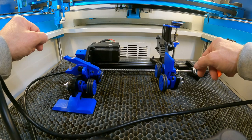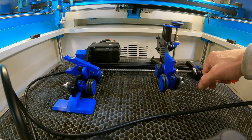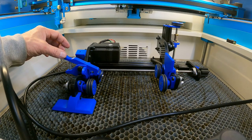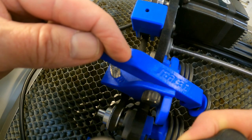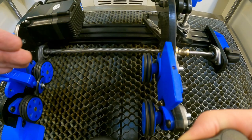Watch what happens when I just push the rotary back a little bit — that orange light goes away, and now the tower is not in the way and you'll be able to move your Z-table up and down. So first make sure that tower is out of the way. Next, you've got to make sure that your rotary is in the same plane as your X-axis, otherwise your design on your tumbler will be crooked. There's a dot on mine, and I put a black dot at the quarter-inch mark of the half-inch-wide frame — you're going to see what we use that for.